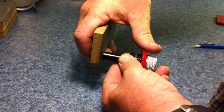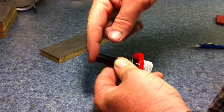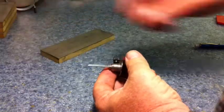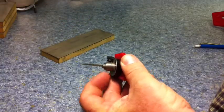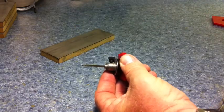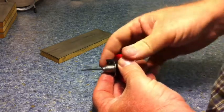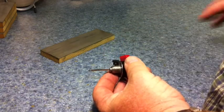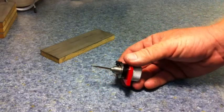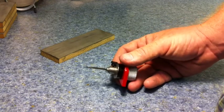You can use a ruler or the bench — anything to push that graver back in to where it's flush with the end of the gauge. From there to the tip is an inch and a quarter, and that has to be dead on. That way, if you sharpen a hundred gravers, they'll all turn out exactly the same — they'll cut the same. That's what's so great about this system: it's consistent and it's foolproof.